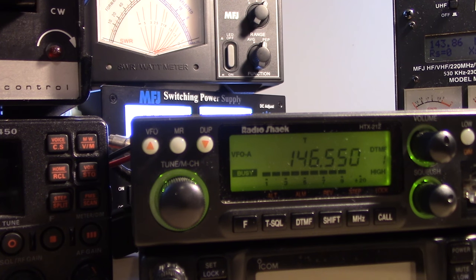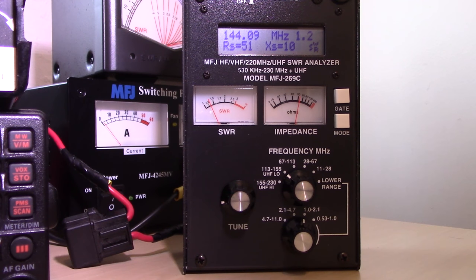John counts twelve total segments on his meter and notes Eric is lit with six of them — just a little hint of noise, but that's from the back side of the beam. Eric acknowledges the S-meter discrepancy with the digital LCD chiclet display. Then, with the antenna flipped horizontal, even with the metal mast, it performs well because the mast is no longer in line with the antenna causing an issue.